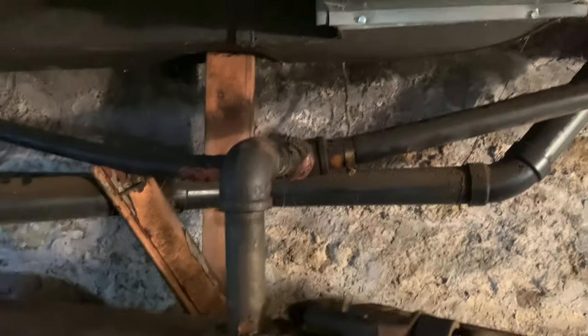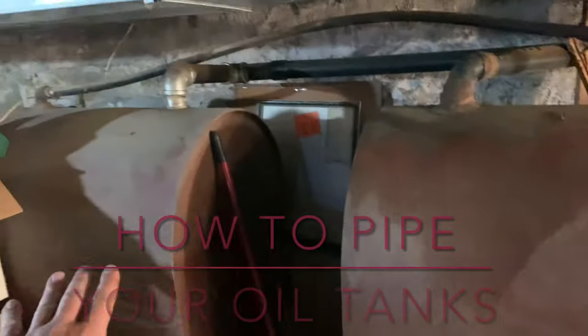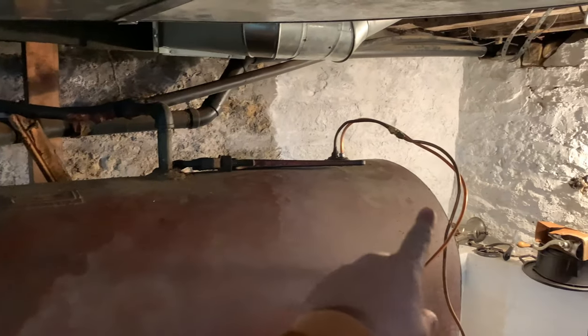As Frontwoods Farmer, what we're doing today is, it's wintertime, and we're getting ready. So we have oil heat, an oil furnace, newer ductwork. And these lines, they don't come in right. If you have an oil furnace with a dual 275 tank setup, the way it should run is these lines should be about in the middle. Those are your lines for your furnace.